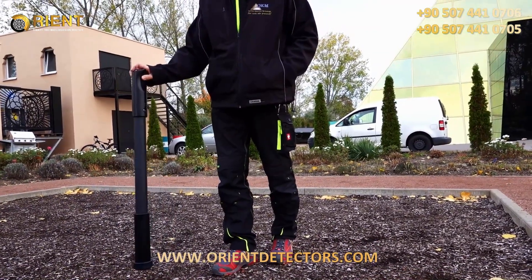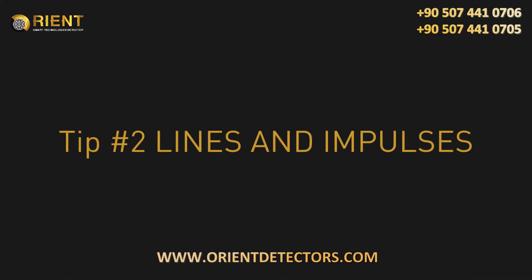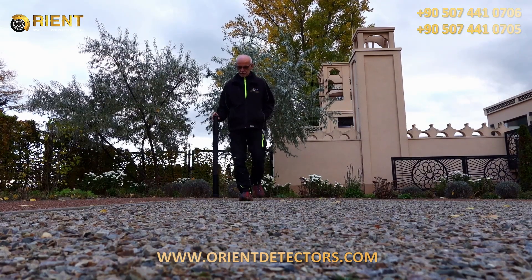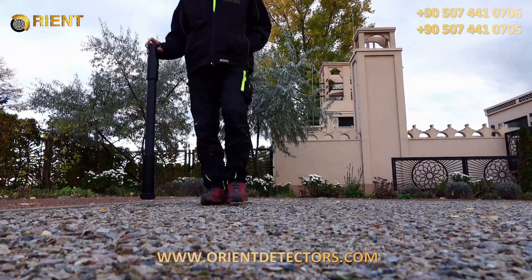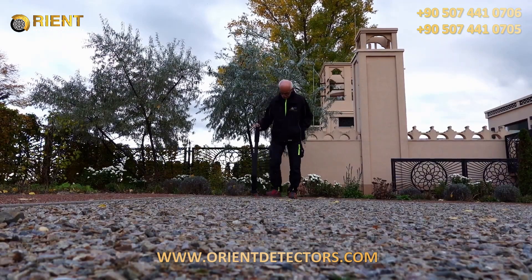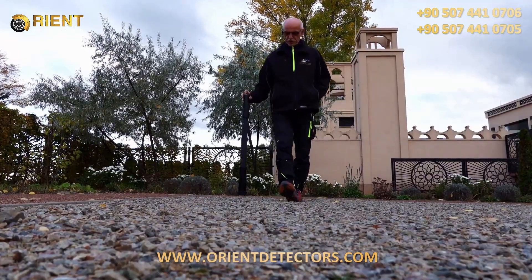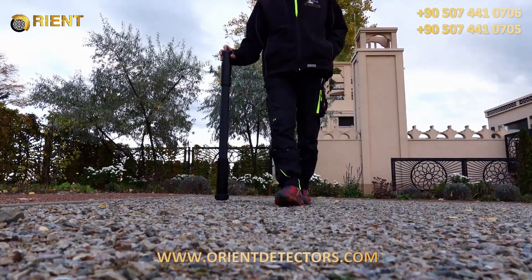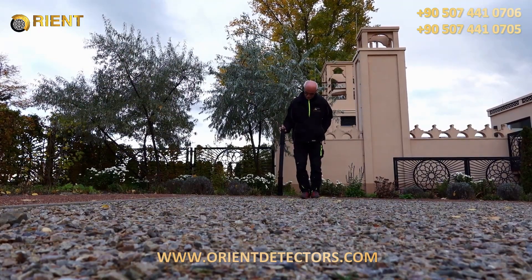Swing or rotate the sensor during the scan. The more measuring points you collect, the more detailed your scan image will be. In this way you won't miss even smaller objects. Walk more scan lines to collect as many impulses as possible, and try to keep the same distances between the scan lines to get an accurate scan image.